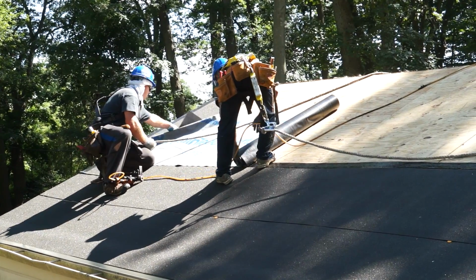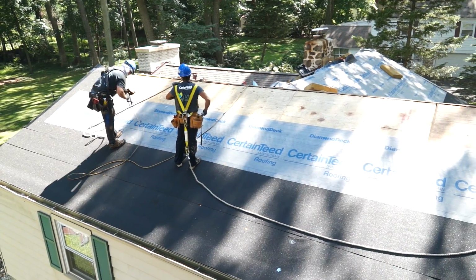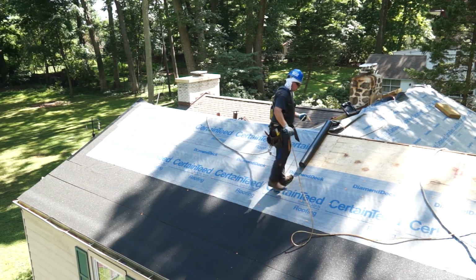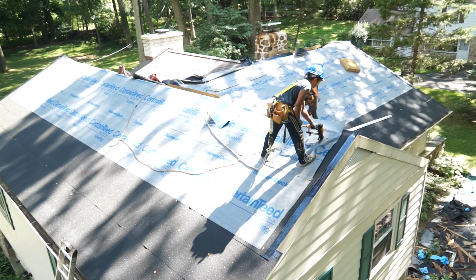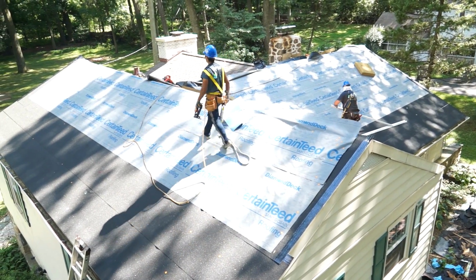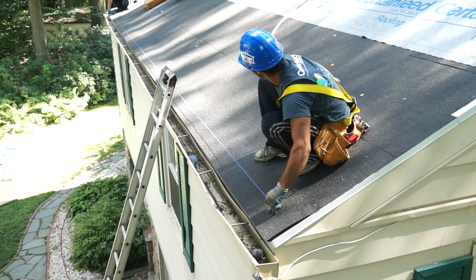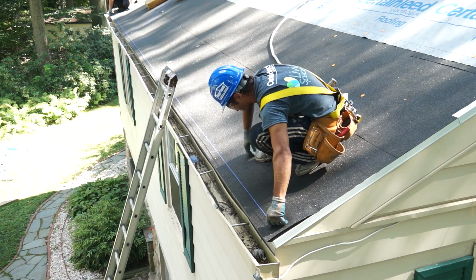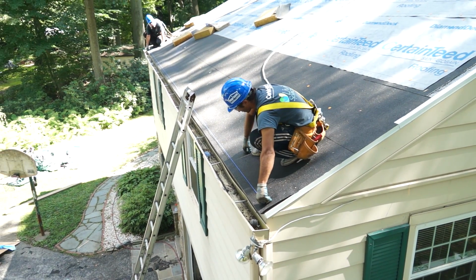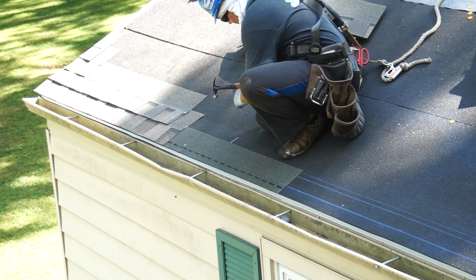Use CertainTeed Roofer Select or Diamond Deck underlayment in warm weather climates or WinterGuard waterproofing shingle underlayment in cold weather climates. Install underlayment over the intake vent, being careful to avoid nailing into the roof deck slot. Using a chalk line, transfer the nail line 2 5/8 inches from drip edge and slot location 5 3/4 inches to 7 inches from drip edge to the top of the underlayment.